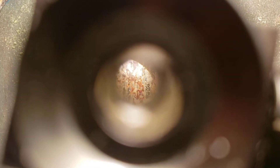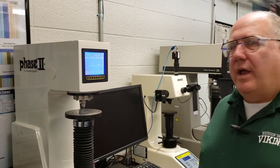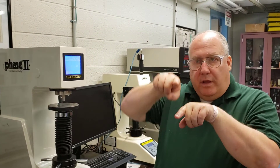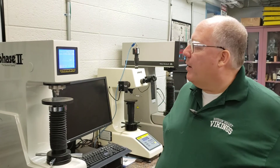You can see the sample — a little hard to make out, but you can see the numbers. The line is a little hard to see; it's much easier when you're looking through yourself. We measured 3.51 and 3.61 as the two diameters — measured across the hole and up and down on it to capture the indentation — and I got the two diameters.